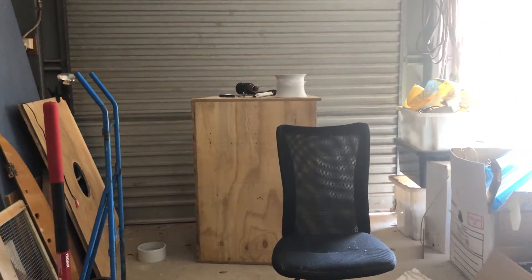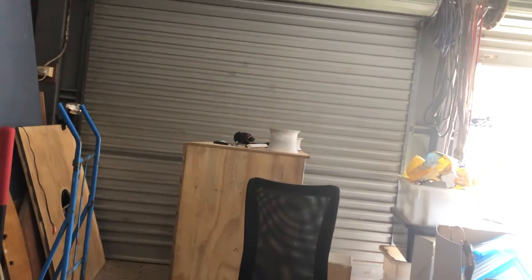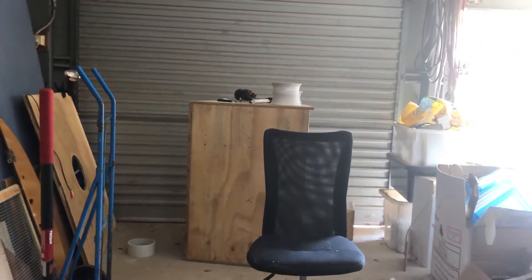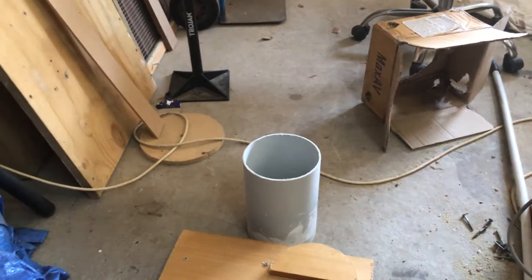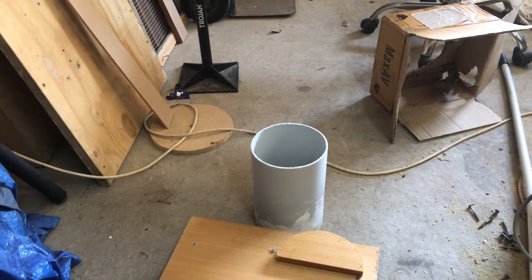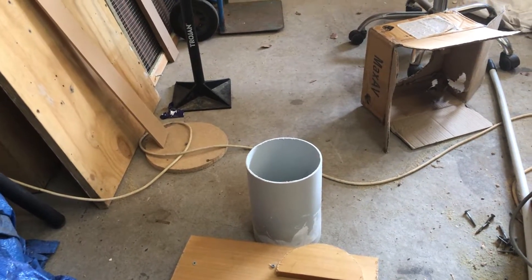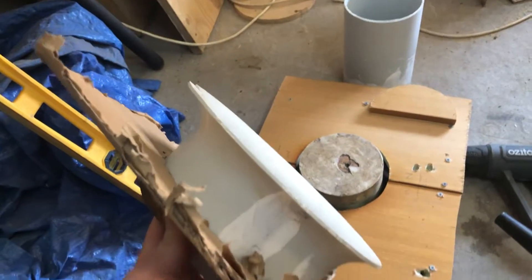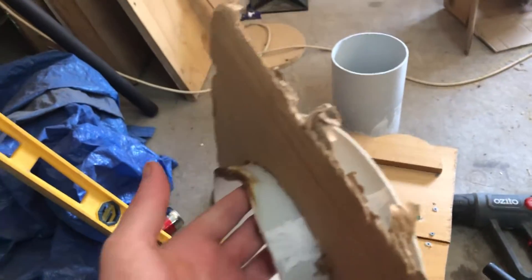In total there is one 15 centimetre port, two 10 centimetre ports, and two 90 centimetre ports. This piece would be the flare for one of the long ones. I'll definitely be able to do another 10 centimetre port out of that remaining piece, and I think I'll have about 14 centimetres left over. If I'm lucky, I should be able to get two more flares out of it — another short one and maybe even one of the long tube exit flares.